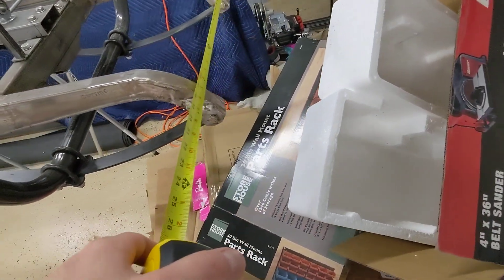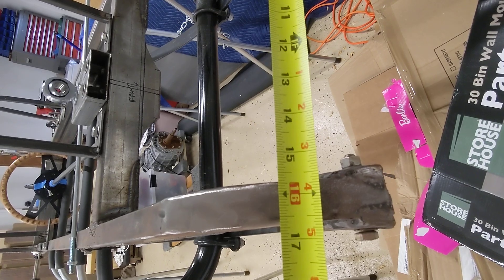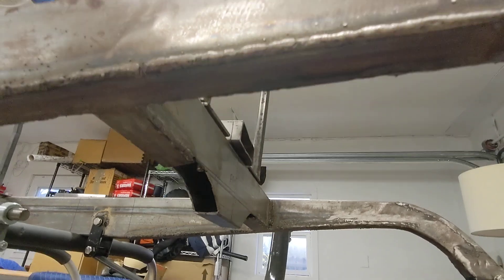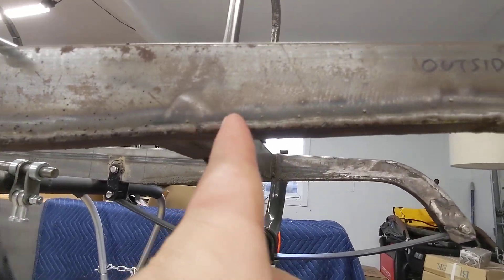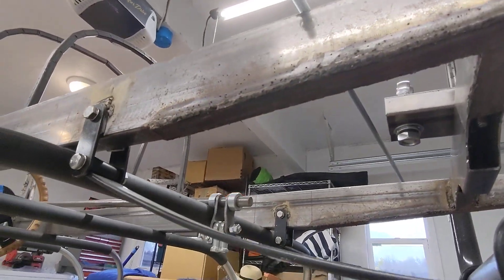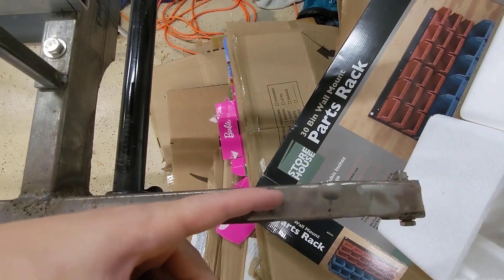So 16 and a half up here. It's supposed to be 17, but I don't know if you can see here — I had to weld all of this on to give myself that bottom piece. On both sides, and when I did that, it warped — it visibly warped in.